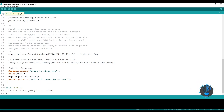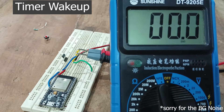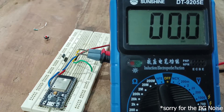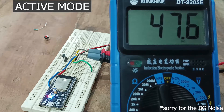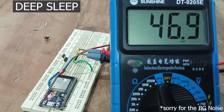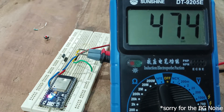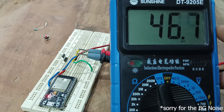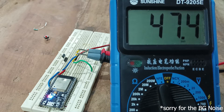Now let's see the demo of these three methods. This is the test setup for timer wake-up of ESP32 — you only need the ESP32, a power supply, and a multimeter. The onboard LED is on, meaning it is in active mode. After five seconds it goes into deep sleep, then wakes up again after five seconds. In deep sleep mode it consumes around 2.4 milliamps, while in active mode it consumes around 47 milliamps, so you can differentiate between the two modes by the current values.